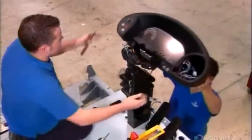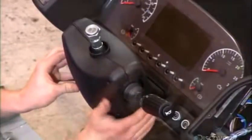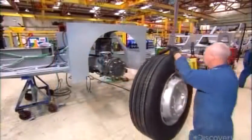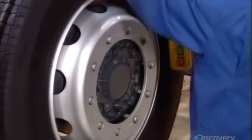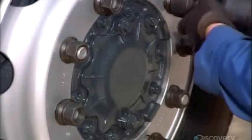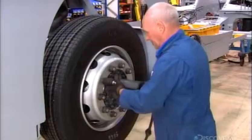At the front of the chassis, they install the driver's binnacle on which all the controls are located. Unlike a stationary car dashboard, the binnacle tilts with the steering column for driver comfort. After installing the front and rear axles, technicians mount the wheels — each one is more than a meter in diameter and weighs 45 kilograms. The engineering specs require the wheel nuts to be turned to a specific tightness. Workers also install the driver's seat and the vehicle's 275-liter gas tank.